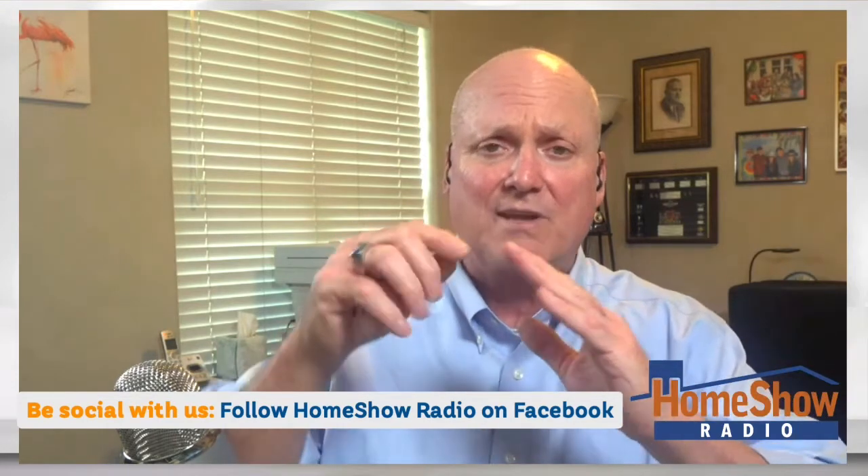If you cut a little bit of your ridge back and there's a little bit of an exposed air space — which could be as little as three-quarters of an inch — you can put a ridge vent on, as long as on a manufactured home you have the proper slope, which means at least a 3/12 roof, better a 5/12 roof. In other words, it needs to be steep enough where water won't flow up into the ridge vent. Some manufactured homes have a very shallow roof, but if it meets the slope requirements and you have an opening, you can use one.